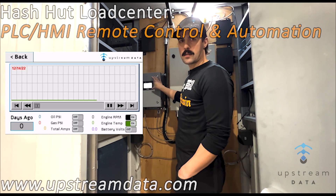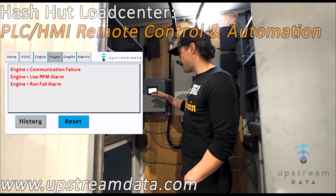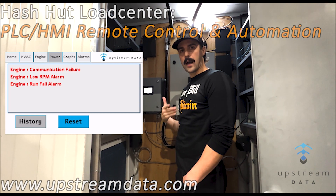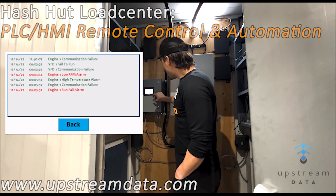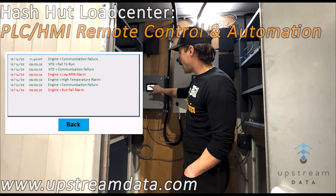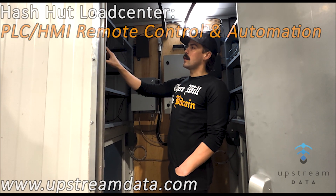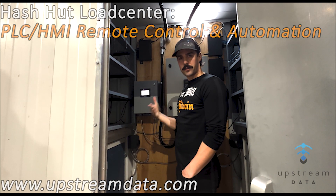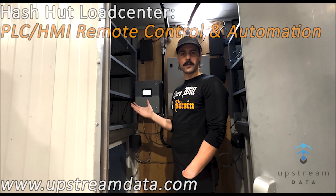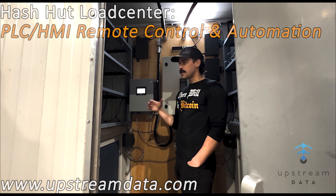There's an alarms page — as alarms come up, it can be programmed to text, email, or call you so you can log in remotely to fix it and reset alarms with history. The one tab not yet finished is the load balancing tab, which ties into our new PDUs via Modbus serial port to the PLC — very responsive, fast circuit control in response to changing conditions like engine overload. That's more or less what the PLC system is about: automation, temperature control, and remote access.